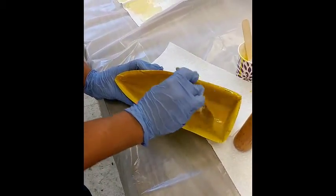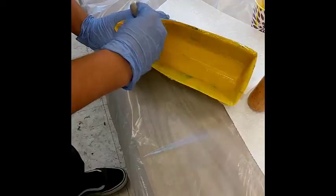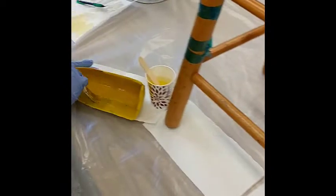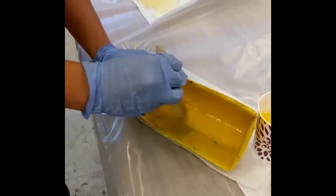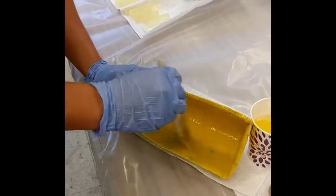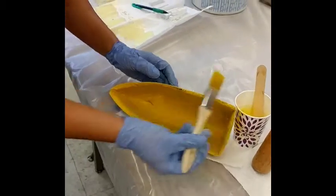So right now we just apply a thin layer of epoxy on the very top. It will give you a very fine, nice finish of our tools. We also added a thickener agent into the epoxy this time to help thicken it up, and it helps fill in any little holes or pinholes or anything that wasn't fully cured, wasn't fully filled in.